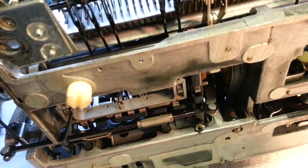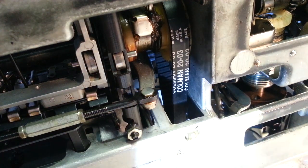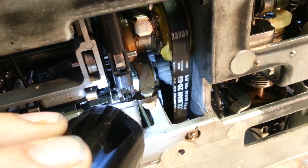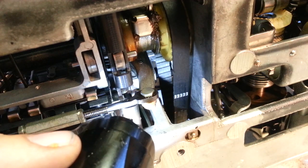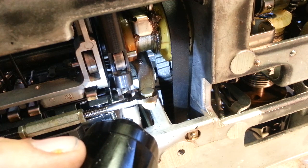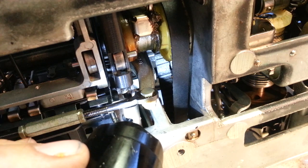In the process of fixing it, the belt got stripped, so it wouldn't even start — in fact it just made a hellacious noise. You can see in here the belt cogs, and even though it's working now, it's got to be replaced. If you look at those teeth, there are some that are bad — one, two stripped out — and the ones on each side are compromised.